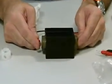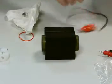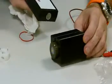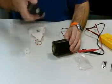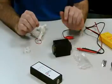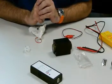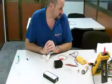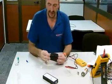Hold for about 3 seconds, release, and taking your beacon tester, you should hear it working. You must then wait for at least 1 minute and then test again and make sure that the activation of the beacon has finished. That is the mechanical aspect.